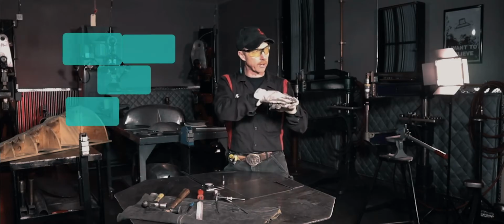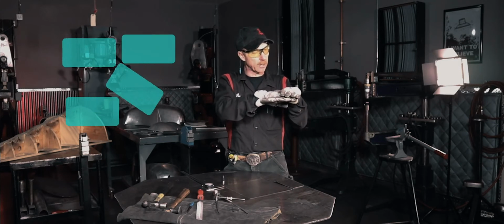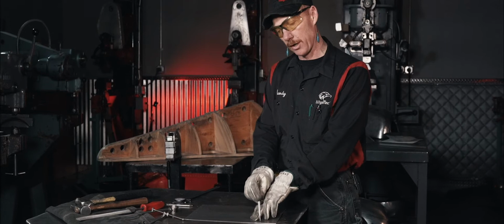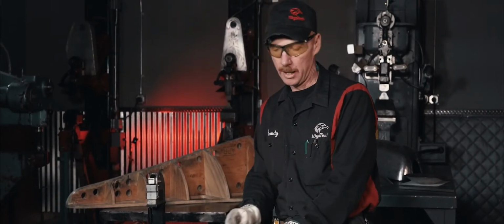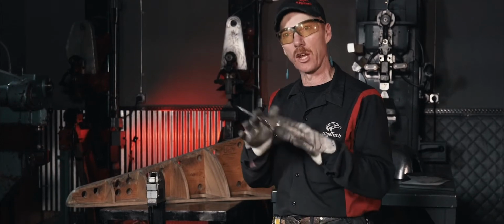And we're going to take the Legos and make a wider pattern of them that will thin the material out, but it's going to have to take on a new shape for it to be able to do that. So by taking the material and making part of it thinner, and we're actually going to make some of it a little bit thicker, that is actually going to force it into changing shape. That's going to resemble that of a bowl, which will be the start of what we get into compound metal shaping.